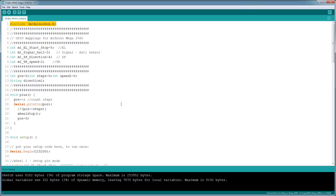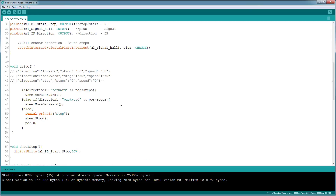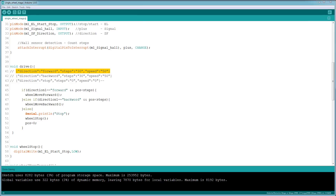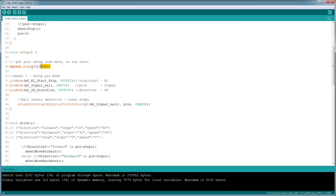To make it easy, I included an Arduino JSON library. We're going to open up our serial comm window and copy commands in there. Next in the sketch, I'm starting a serial and setting up the pin modes: start/stop is set to output, hall sensing is set to input, and direction is set to output. I also attached an interrupt to the hall sensing pin — which is pin 3 — to count steps.